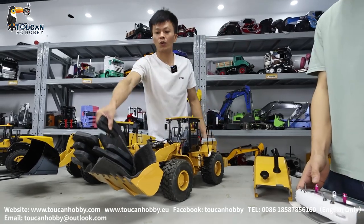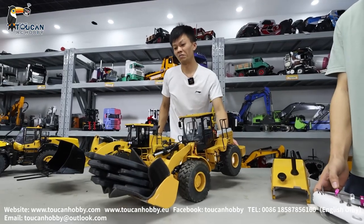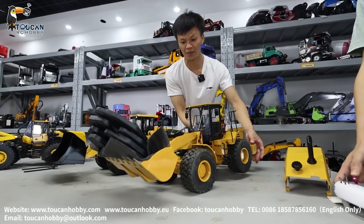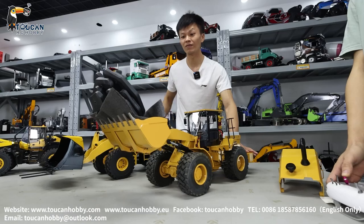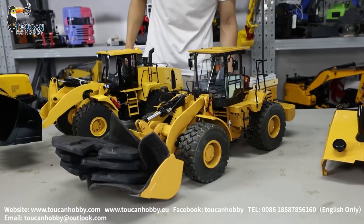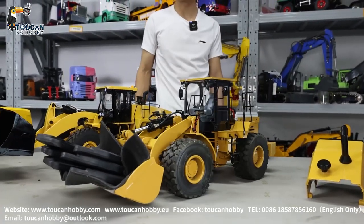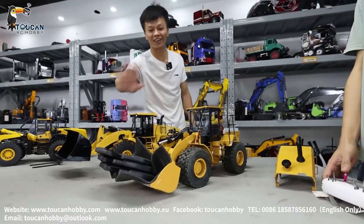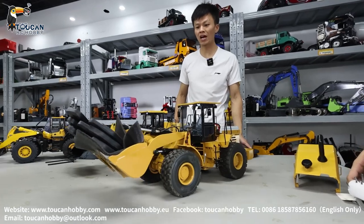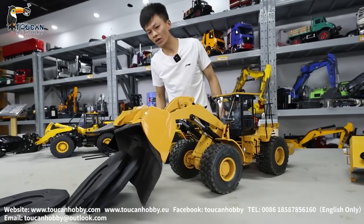What is the pump load? So we increased from 50 to 80. Now see if we can rise. Yeah. Maybe 7.5 kg, 8 kg, that's the limit, because now with 10 kg the rear side will lift up. Before, when you hold it, it can still go in. Okay, you can run it with 7.5 kg. Try the movements, go forward and back, then unload it, lift it up and unload it. Hitting it is fine too. Okay, maybe when we load and unload, it will fall on the table. Pump is now at 80%. Yeah, it's falling on the floor. 7.5 kg.